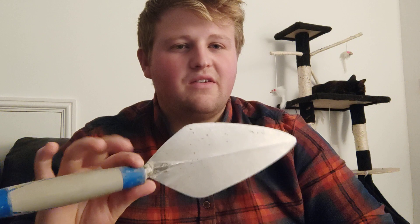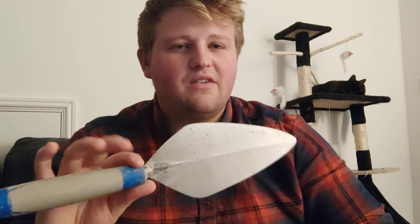I've been using this narrow London 9-inch trowel now for about 3 weeks. What I can say about the narrow London as opposed to a wide is you don't pick quite as much up. You can see the length difference isn't that much — it just goes to a narrower point here, whereas the wide is a wider point. The surface area difference probably isn't that much. I don't find myself spreading any slower with a long spread using the 9-inch, and it works through the mortar a lot easier.